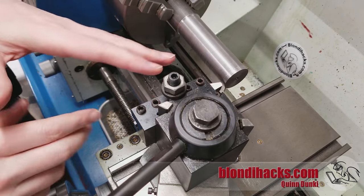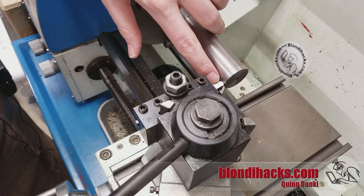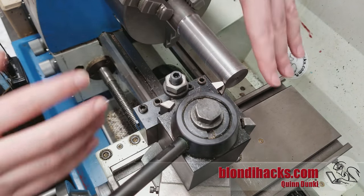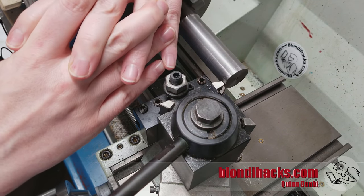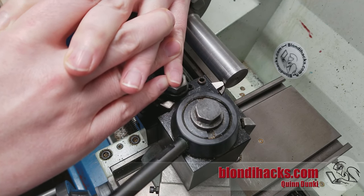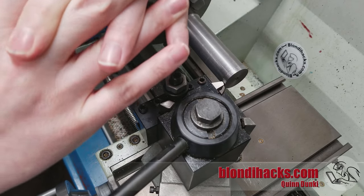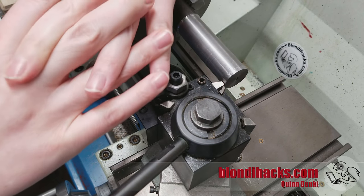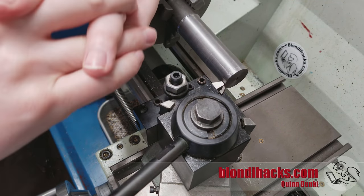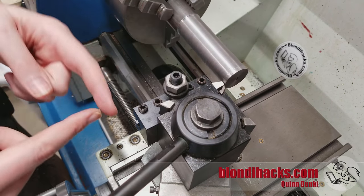Remember back in part one when we said that everything was a spring? Well, chatter is where that chicken comes home to roost. When this tool bit is engaged in this material, the downward tool pressure is transmitting all the way through this machine. This whole system of parts becomes a whole set of springs operating as one. What happens when things start to chatter is a harmonic gets started somewhere in that system and it'll just start growing and growing — pretty soon the whole machine, at a microscopic level, is just doing this little dance. And if you get a standing wave, it'll even start building on itself, which you heard a little bit of in the demo. So that's chatter in a nutshell: it's a harmonic wave that gets set up in your system of springs.